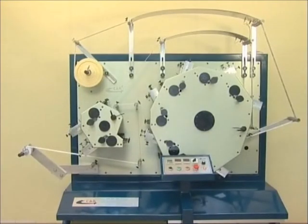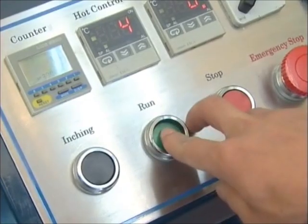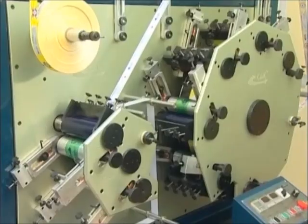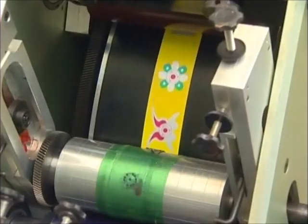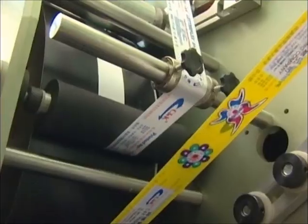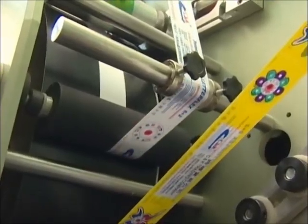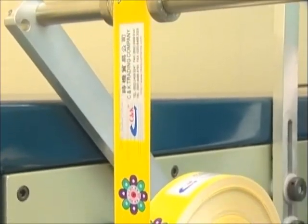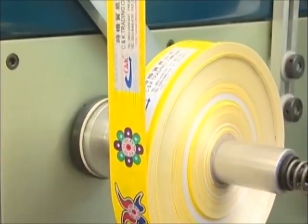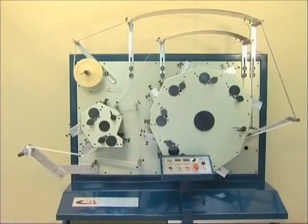The printing machine adjustment is finished. Press the run push button to print. Pay attention during the printing process to whether the ribbon is displaced, or whether the heating plate temperature is not adjusted correctly, and whether the ink is still wet or causing dirty marks on the ribbon. When anything unusual occurs, press the stop push button or emergency stop push button.